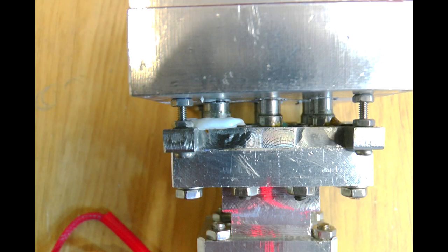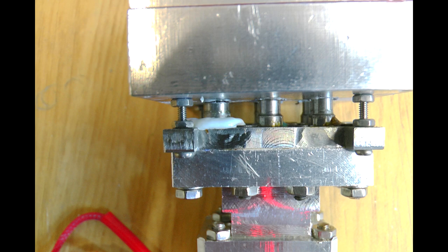As a last-minute update: we've got the hot end off now. Here's a close-up showing the leak around that heat break — it was just that one, although there might be a little bit of ooze from one or two of the others. The rest is fine — no leaks anywhere in any of the plates that make up the mixing chamber or anywhere else. Everything's quite well sealed; I'm quite pleased about that.